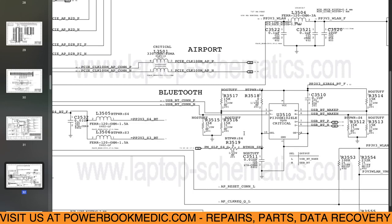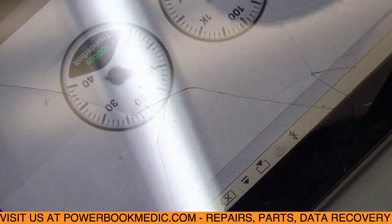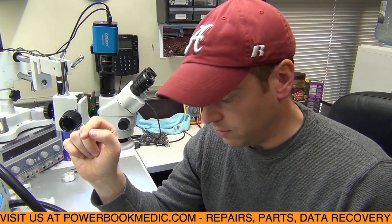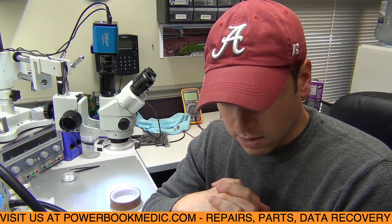Get back over here to the camera and take a look at what we have now for Bluetooth — we don't have a line through it anymore. Our Bluetooth is working good, we have fixed the problem. So what do we learn from this? It's good to get an idea by looking at the schematics and the board view of what it might be. We were able to just look under the microscope really quick, use our eyes, and found a missing resistor — that was the problem. We replaced that resistor, really easy fix, and we got this customer's board back up and running. Bluetooth is good, Wi-Fi is good, everything's working great. Hope you enjoyed this video and hope you learned something — I did. Have a nice day, we'll see you next time, bye-bye.